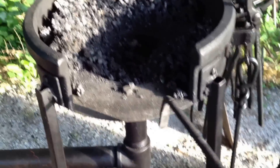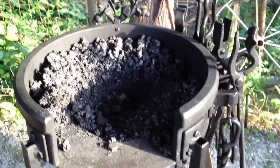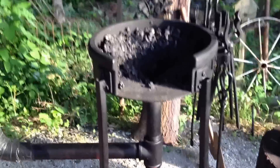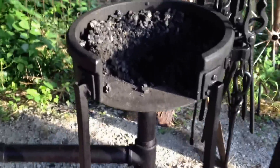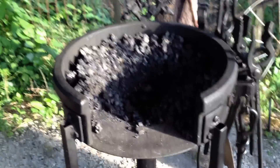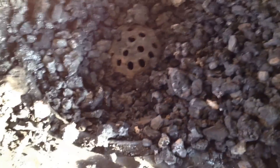My forge — this is a culmination of hundreds of ideas I got off the internet, a little bit of my imagination, trial and error, and mistakes. Here's the basics: I went to a heavy truck repair shop and they gave me a brake drum off an international dump truck. A car brake drum wasn't quite big enough, so underneath there is a car brake drum that fit perfect in that hole — I actually had to hammer it into place. I bolted that in, used a cast iron floor drain, and I can forge all day on this sucker. Works great.